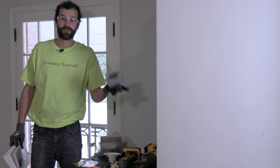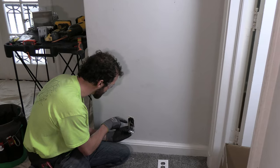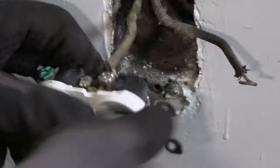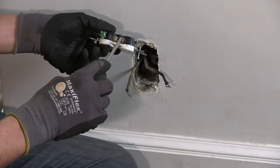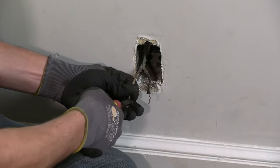In newer homes with non-metallic cable you can use a plastic box — I'd recommend that, it's just so user-friendly. Now let's get this pulled apart. One thing to be mindful of on these old wires: you can just barely tell which is the white and which is the black conductor, and they are going to the proper destinations — nothing's been mixed up. You do need to be circumspect; I can't take for granted that just because it tested right that everything is color-coded properly.